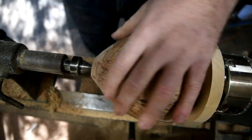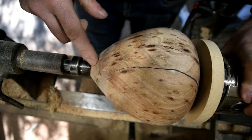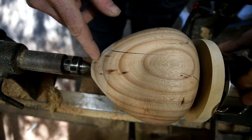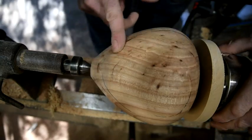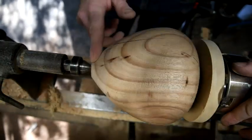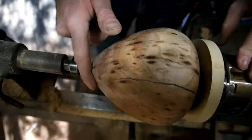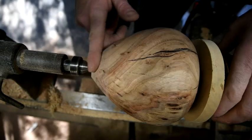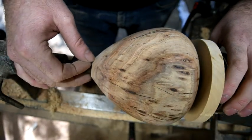I don't know if you can see some of these eyes here. I need to just chuck a little bit of bog in them. I got some quick drying stuff, so I'll just give it a bit more of a sand, get the shape right, and then quick fill, come back in half an hour or so and finish off sanding, and I'll just part it off,